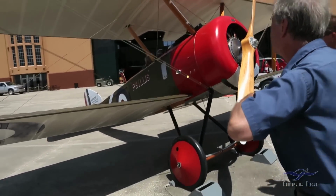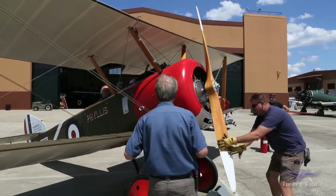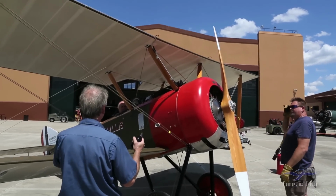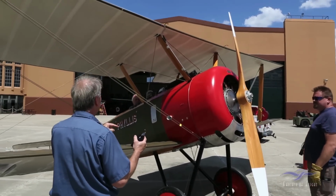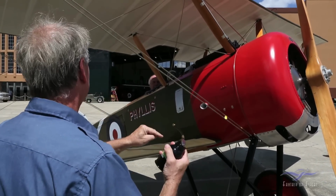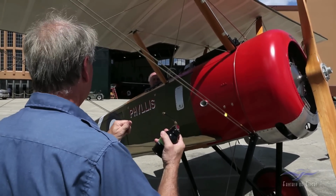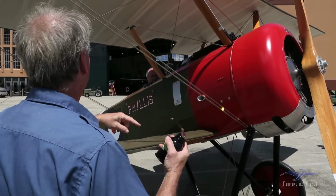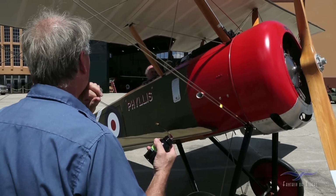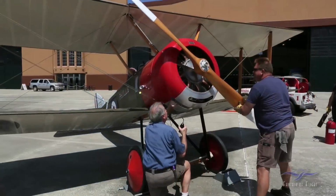Everything's off. We'll do that whole exercise again then. Did you get all the cylinders or just... No, I remember now, it's just the same as the snipe. What you have to do is get each alternate cylinder off the cutout. So he goes round two, I squirt, he goes round two, I squirt. So unless you go all the way around twice. But I don't think you need to do that. I mean, that fired up quite happily. Yeah, separately. You're right, okay.